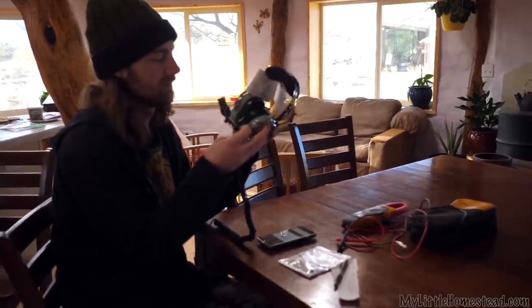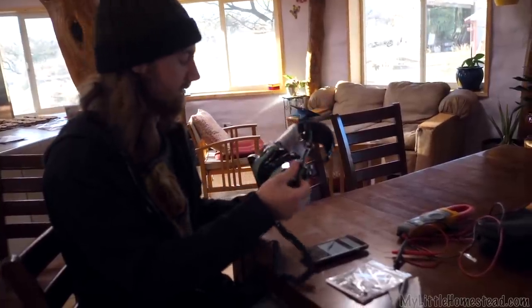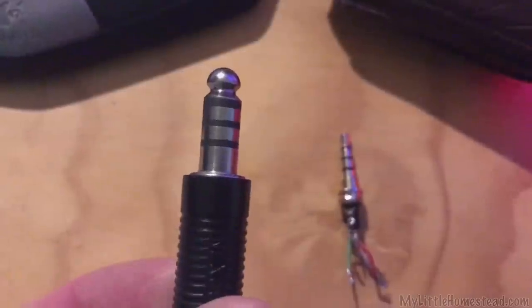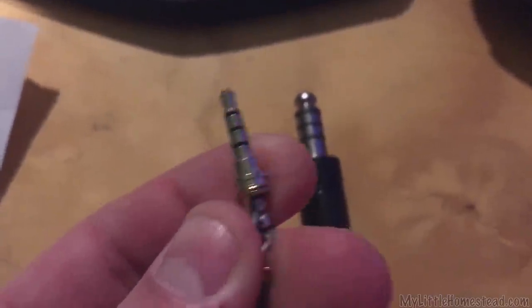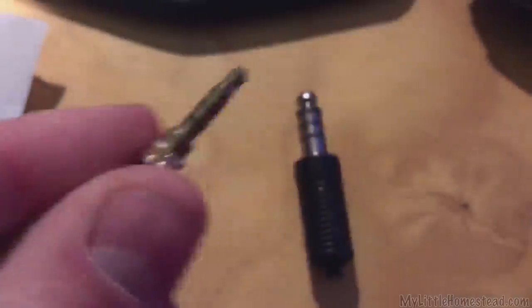I picked up a pair of these really cool aviator headsets for a helicopter and planes and stuff like that, and I wanted to hook them up to my computer. The plug on it is an old, I believe they call it a helicopter jack. I want to switch it out with a TRRS connector. This one's nice because it can be easily adapted to PCs and laptops — you can just plug it directly in.